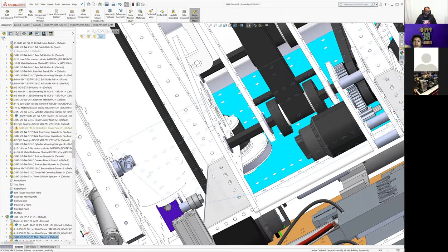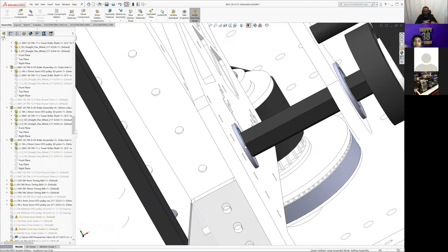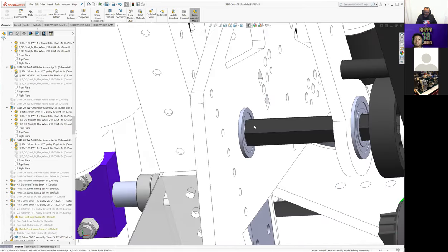It doesn't cost us much, and it makes insertion not too much more difficult. Even if you're trying to pull belt tension, you can get the threads into that counterbore hole, and then get it caught into the actual thread and threaded in, and it works relatively well.